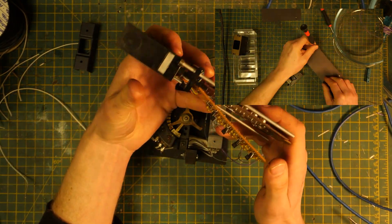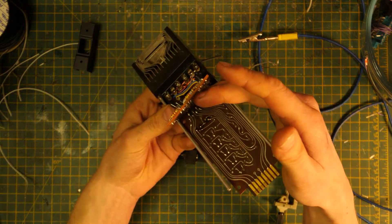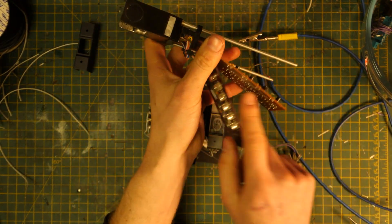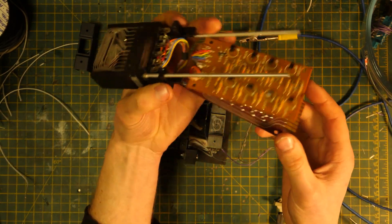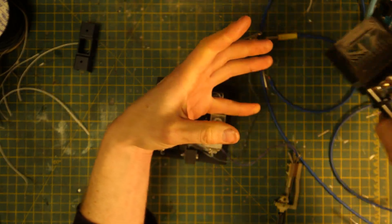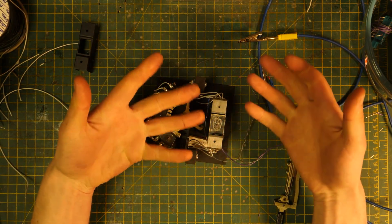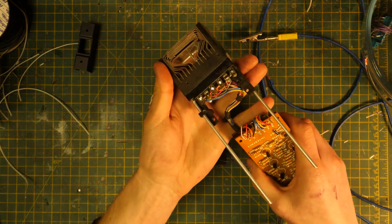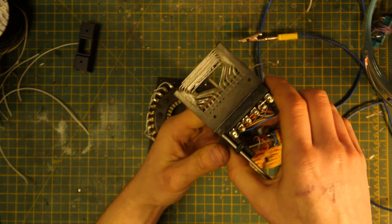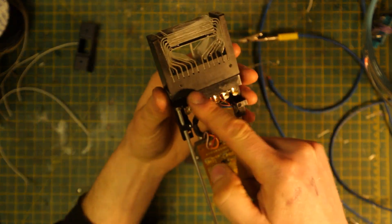Unless I'm using it wrong, but I'm pretty sure I'm not. I just think a few of the transistors aren't playing ball, so I'm giving it a break. I spent about an hour or two just looking through and trying to figure out where the problems were lying. The main thing was understanding this is the interface board and this is the decoder board - it basically takes in four bits, four pins that take the data to choose which number is displayed. It's really cool but I haven't quite got that figured out yet. This other one that Mike dropped off didn't have the decoder in the back, so I can do whatever I want. This looks a bit like the one that Fran Lab covered about three months ago - these are acrylic plastic where it shines and diffuses on the front, and the bulbs are in the back.